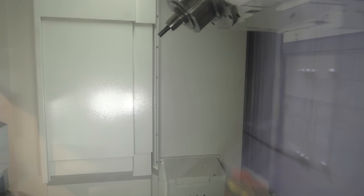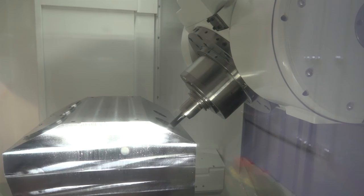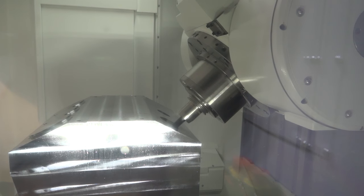How about the build quality? It's a more cost-effective machine but I presume you've still got the build quality of the Integrex? Yes — first and foremost it's a Mazak machine. It's a fully cast product, runs on roller linear guides, the B-axis is a roller gear cam design, so very stable, able to output high torque but also able to give smooth contouring and full 5-axis simultaneous motion. It's also a very agile machine with 52 metres per minute rapid traverse performance.